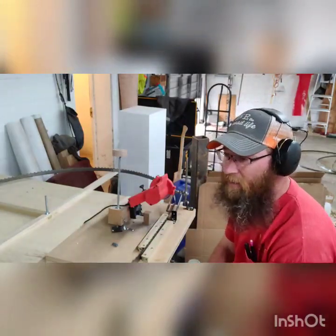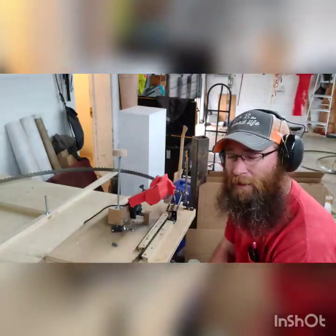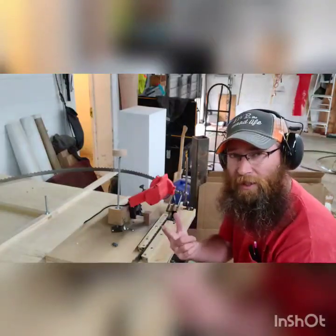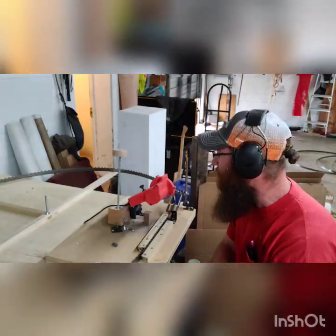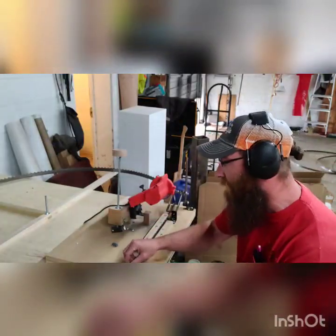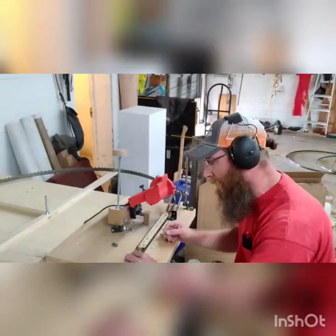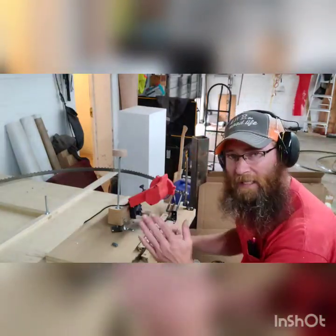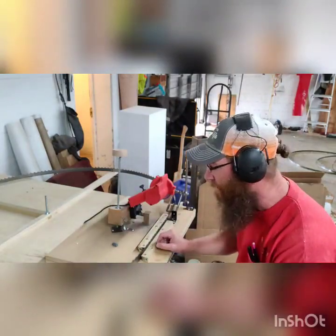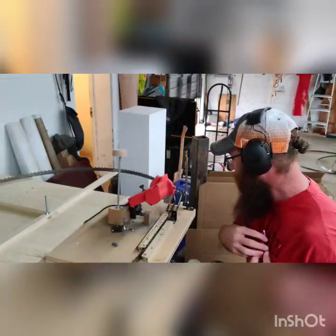But, you know, I also think if there's maybe 3 teeth on here that aren't really perfectly sharp, then that's not going to be a big deal if the rest of the blade is still really sharp. Though, given that I have bearings in here, I could easily move a blade back. So what I might do is when I come across that, I might just bump the blade back into the grinding wheel just so I hit that face and then move on to the next one. So yeah, I'm going to get this one started here.